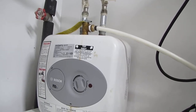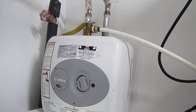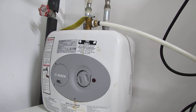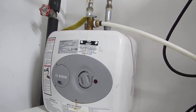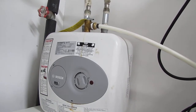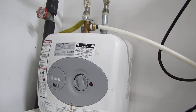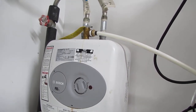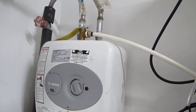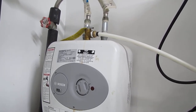That's exactly what happened in this case right here — this tank ruptured from lack of an expansion valve. They do make both an expansion tank system and also an expansion valve, so go check your water heater to see which one is there. If you don't have either, I recommend you install one, especially on any tanked water heater regardless of size, because it can very likely damage your plumbing system or even cause a spectacular failure of the water heater.